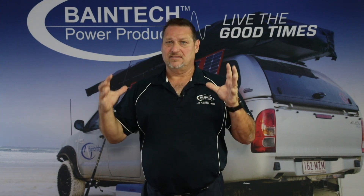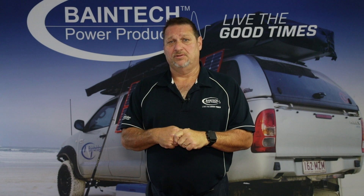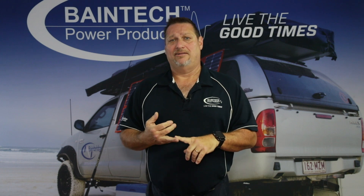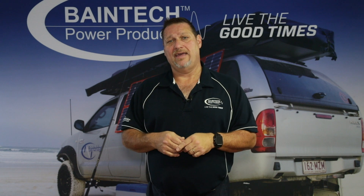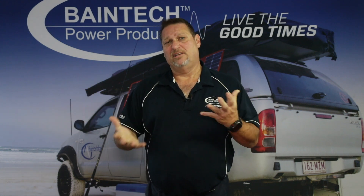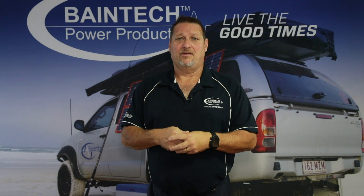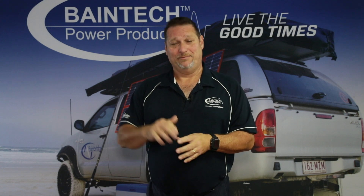What you are saving is a lot of weight. Around a 75 amp hour lithium is more than enough for the average person to run their fridge and lights for a weekend camping. If you want to run for extended periods, look into a solar blanket to replenish power during the day. If you need three or four days or longer, maybe step up to 110 amp hours. There's a little bit of science behind it but it's not too technical — there's no point buying bigger than what you need as these are expensive pieces of equipment, but they will last you a long time. If you need any more information, please don't hesitate to give us a call.